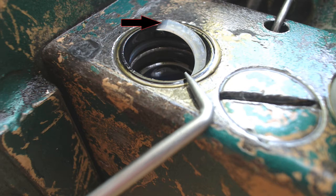The first item I'm taking out here is the backup ring. They're made out of plastic, usually PTFE. Now if you look where the arrow is pointing, you'll notice it's cut back on an angle. I pull the bottom of the backup ring out first - this will be the portion that goes in first. Make sure you put this in first or you're definitely going to have o-ring problems when you go to reinstall the o-ring.